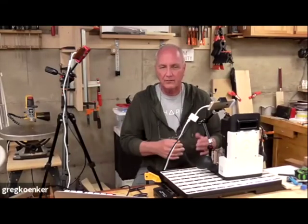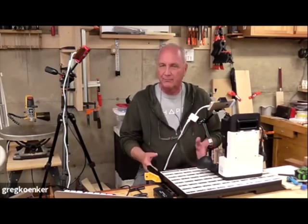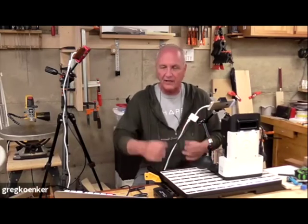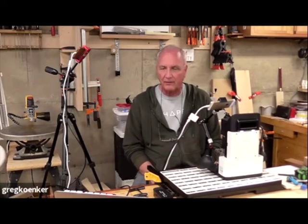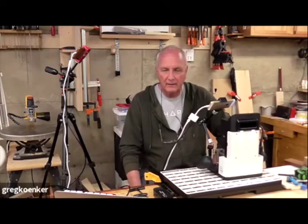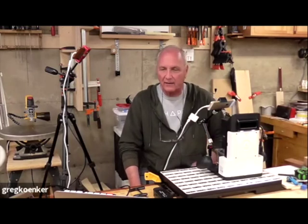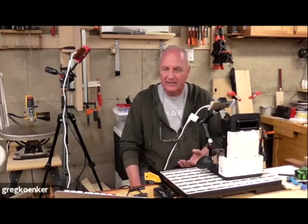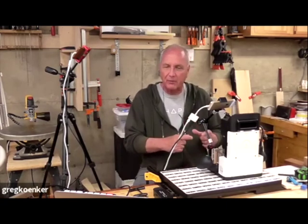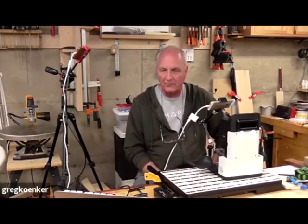Which is a good reason to rescan, even if you're cutting multiples of it. You put another piece of wood in there, rescan it so, like you said, you can see the grain. It's very helpful for cutting parts out. If you're going to do 4 legs, the 4 pieces you're going to use may not be exactly the same. So it's great if you're doing a patch, you know, you've got a flaw in a piece of material and you want to hide it. That particular portion of grain you're using, you want it to look as much as possible like where it's going to go, right?